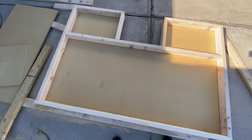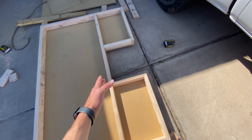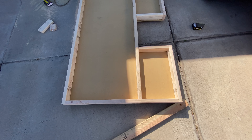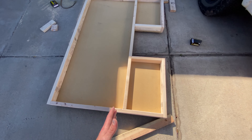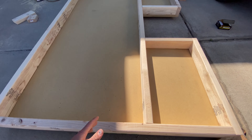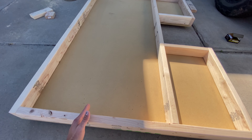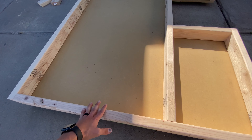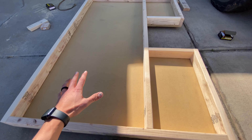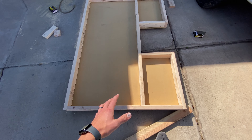So I got the one going across the back, two on the sides, and then one right at the back of the opening just to support the whole front section. This thing is going to be pretty heavy with it being four feet wide and three quarter inch MDF. If you wanted something lighter and smaller, you could do five-eighths MDF and cut it down to maybe 40 inches. But I wanted to take advantage of as much space as I could — one section as a workbench and the other for cutting.